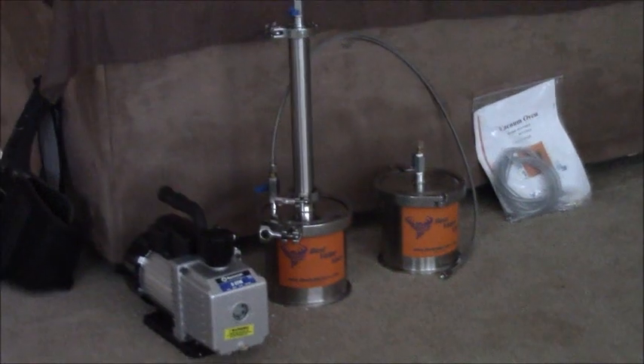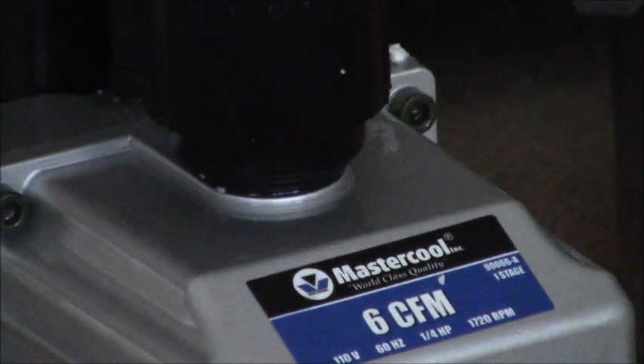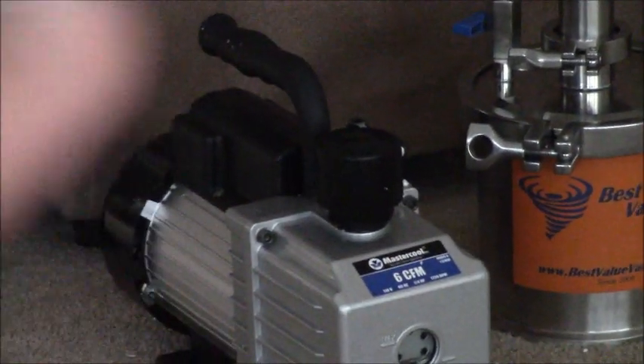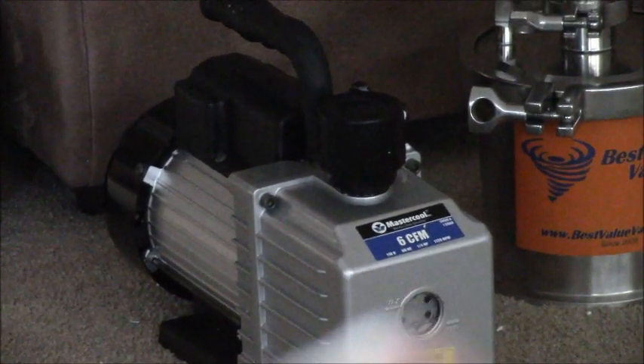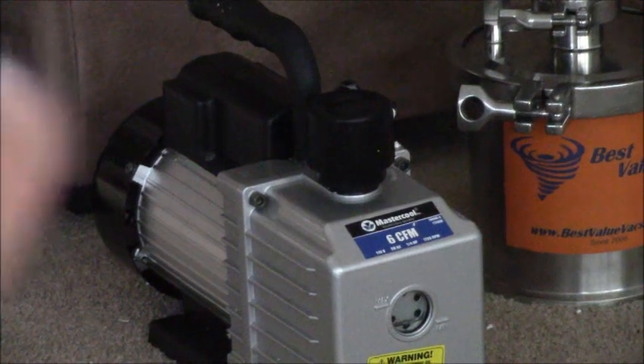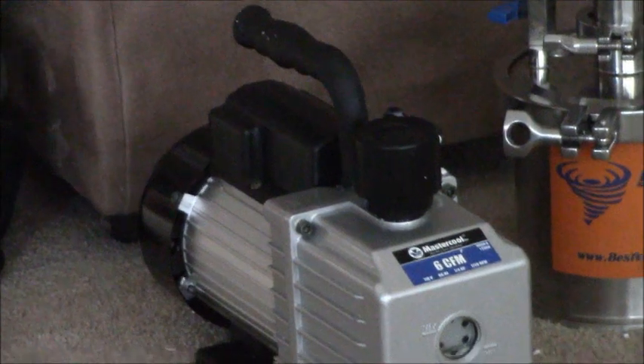Here's the pump — it's a two-stage, six CFM Master Cool. I gotta read the directions on there. A lot of people are starting these up and there's a little rubber cap that you gotta snip off before you run it. The only thing I noticed is when it was shipped it was already full of oil, and they shipped another bottle but sent it upside down so the oil got everywhere — but that's a UPS thing.